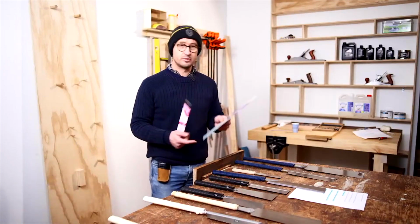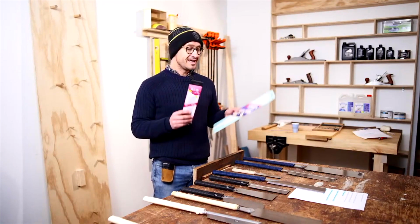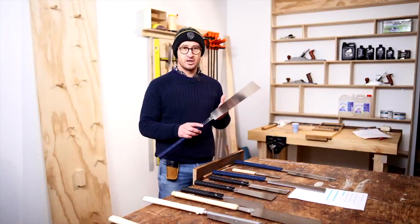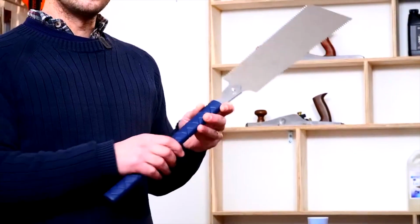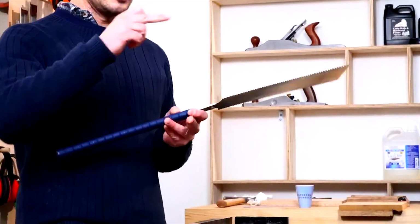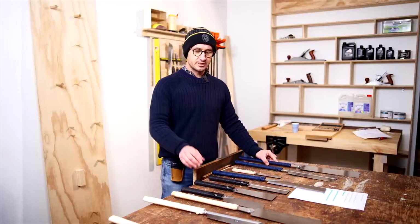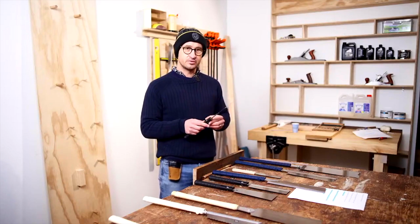They come in these cool little packets here, very thin packet. See that? And in different sizes to suit the saws. There is a little bit of interchangeability between the different saws and blades. So, for example, you can pretty much fit any Ryoba blade onto this handle. So if you really get fond of a handle, these new blue kind of grippy plasticky ones are pretty cool. You can put a smaller blade, if you like, onto that same fitting, just to change the balance of the saw or suit whatever you're doing, different TPI and so on. Some of them you can't really do that, so these little single-handed ones, there's not a lot of flexibility around the blades that each handle will take, so there's a limited amount there.